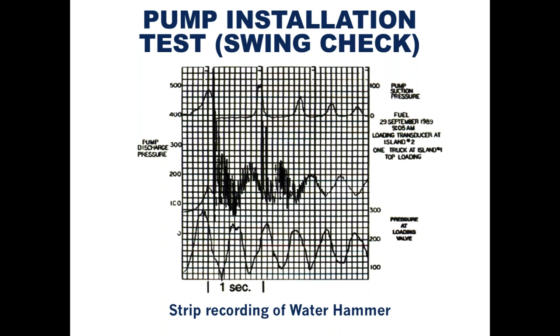Based on the proven successes in the past, the consultant knew that the dual-guided, inline, spring-assisted design of the DFT Excalibur would prevent backflow from occurring. With no backflow, the cause of the water hammer would disappear. The very economical recommendation of an 8-inch Class 150 DFT Excalibur was accepted by the oil company. The valve was installed, and all of the vibration, noise, and system damage was eliminated.